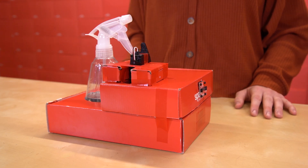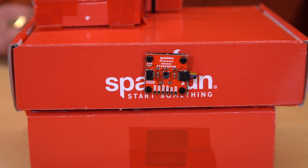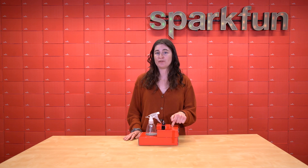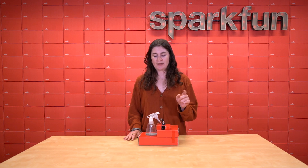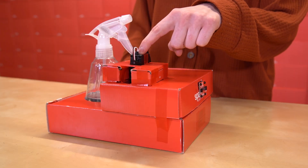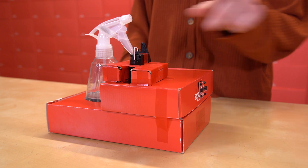This project is comprised of a few pieces: it has the human presence sensor on the front, inside there is the SparkFun RedBoard with the quick attachment, and that is outputting to a high torque servo motor here, which will then hit the spray bottle and hit the target.